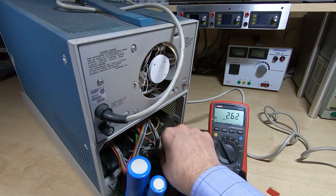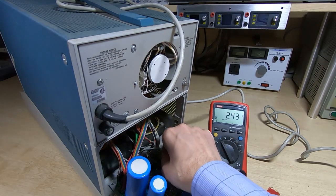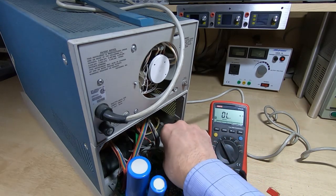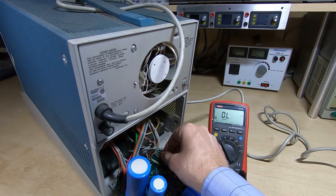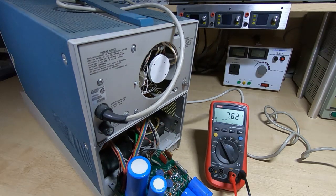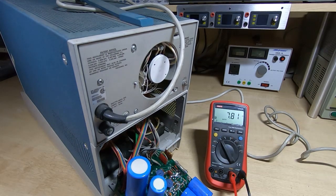So it was about 7-8 ohms, and we're now seeing 2.4. So that sounds about right. I can put them back. Again, it should return to about twice that resistance. It won't be quite, it'll actually be more than twice because the high voltage windings are thinner, so it will be slightly higher resistance, but we can see that it is going the right way.